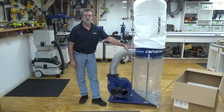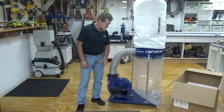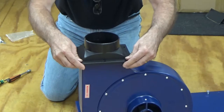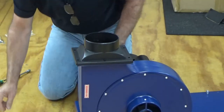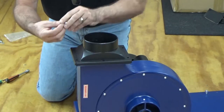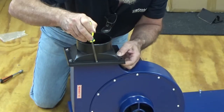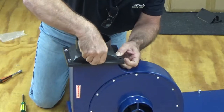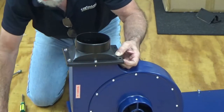Fit the adapter for the five inch dust hose on top of the impeller outlet. Ensure you place the rubber gasket supplied in between the impeller housing and the adapter. Use six quarter inch bolts, nuts and washers supplied with the spanner that is also supplied. Using a Phillips head screwdriver as a podger will make placement of the bolts a lot easier, aligning the adapter, gasket and mount holes.